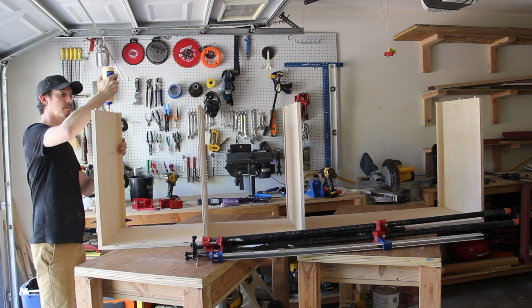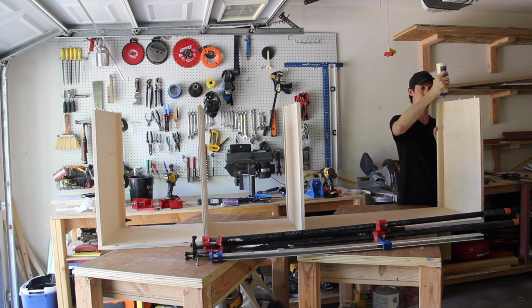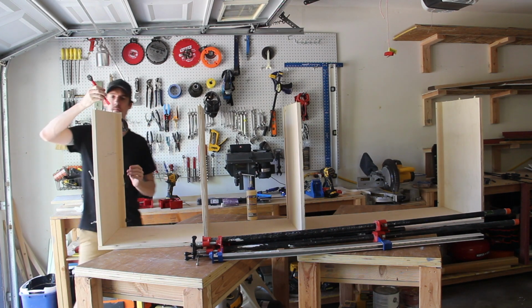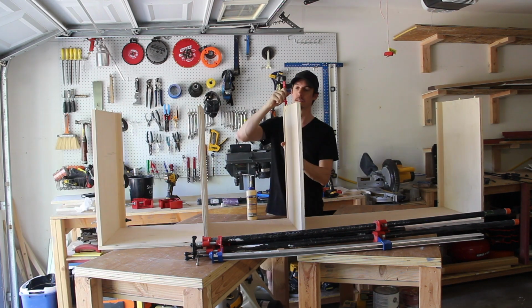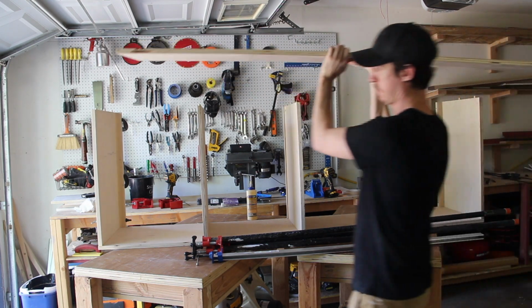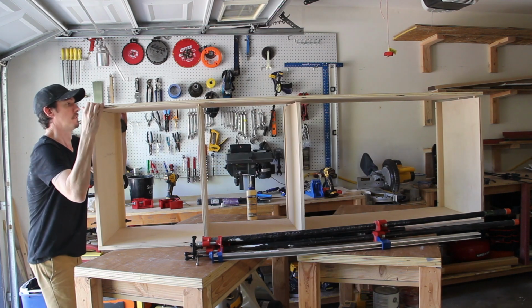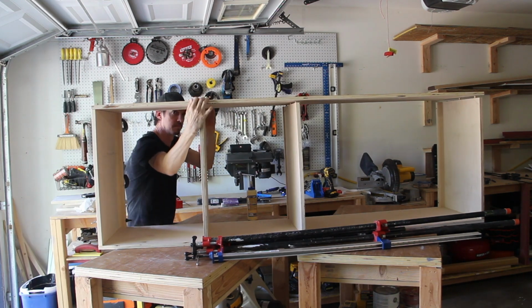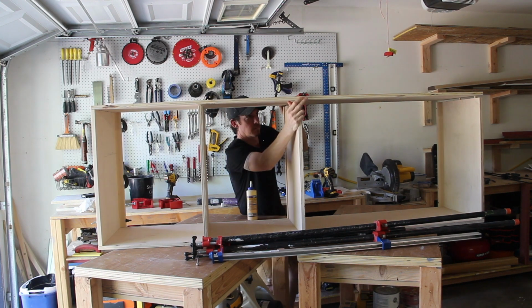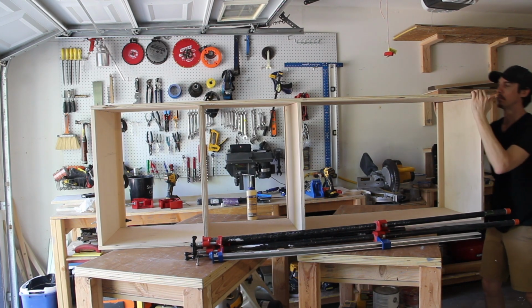Now that the cabinet trim was all secure, it was time to add the top piece. And this is the moment of truth. Would all of my dowels line up? I had to do this all in one pass and put glue on each one of the vertical panels at the same time, and then get the top panel on and clamp down before the glue started drying. And this day is like 105 degrees Fahrenheit in Austin, so glue dries super fast.